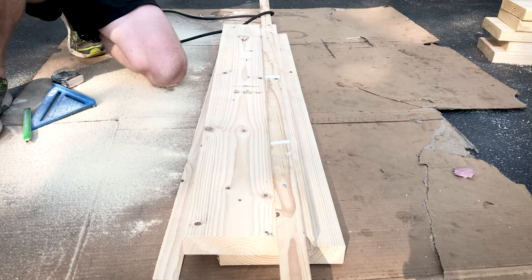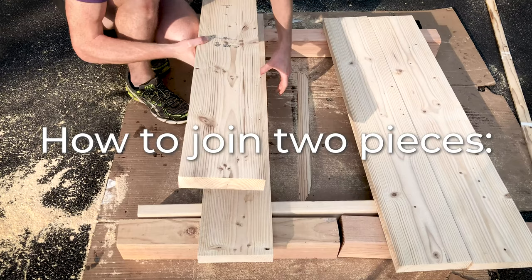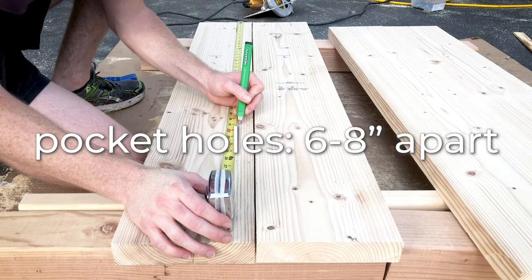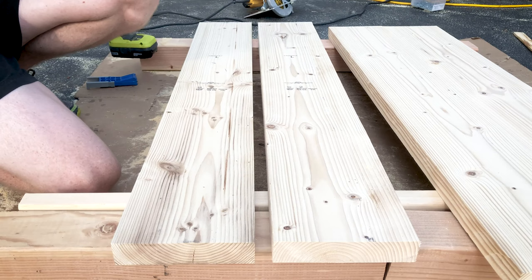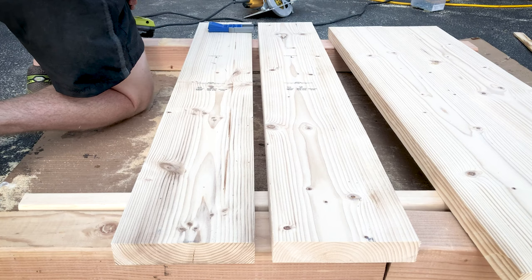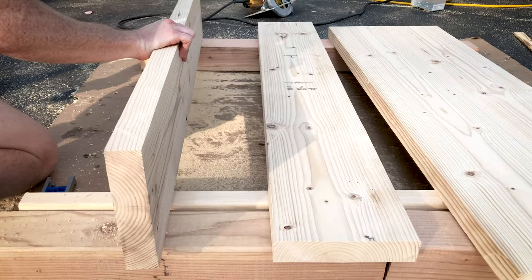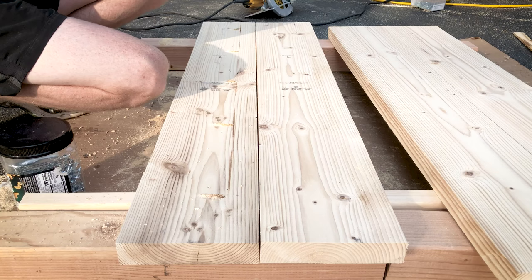Everything is cut, and now I'm going to show you how I join two pieces of wood together. First, I flip the two pieces upside down because I'm going to use a pocket hole jig to screw these things together. I measure out where my pocket holes will be. Most people suggest spacing pocket holes 6 to 8 inches apart, but since I'm strengthening this joint with wood glue, I typically place them 12 inches apart. I also make sure one hole is placed 3 to 4 inches from each edge. Once my markings are made, I'm going to drill all of my holes into one of the boards. I'm using a Kreg jig, and when using this jig, you should use a clamp to make sure it doesn't move on you when drilling.